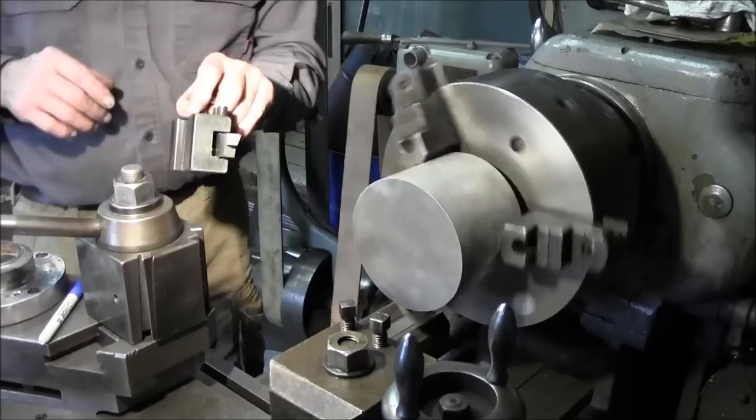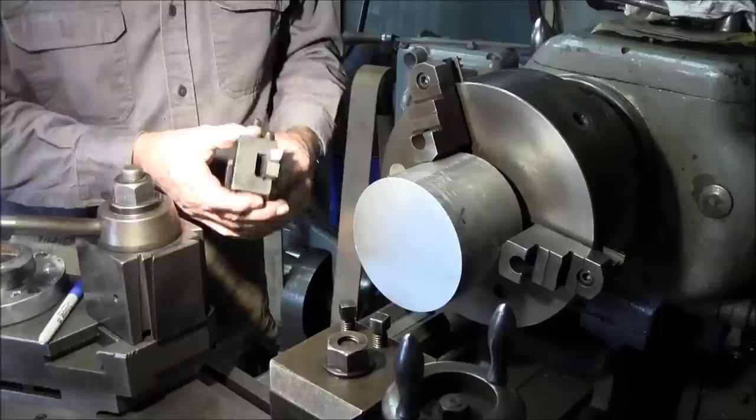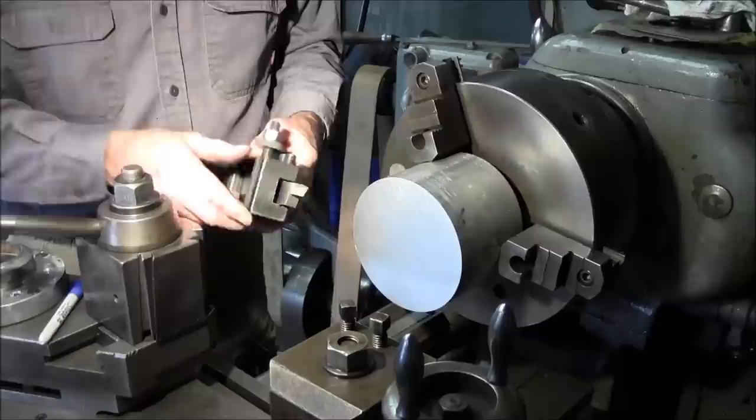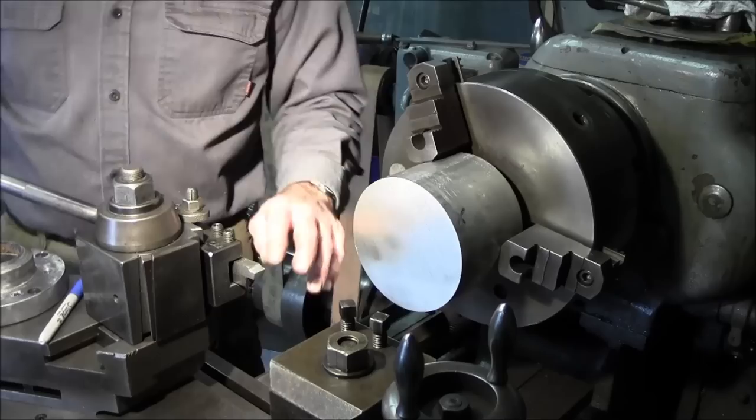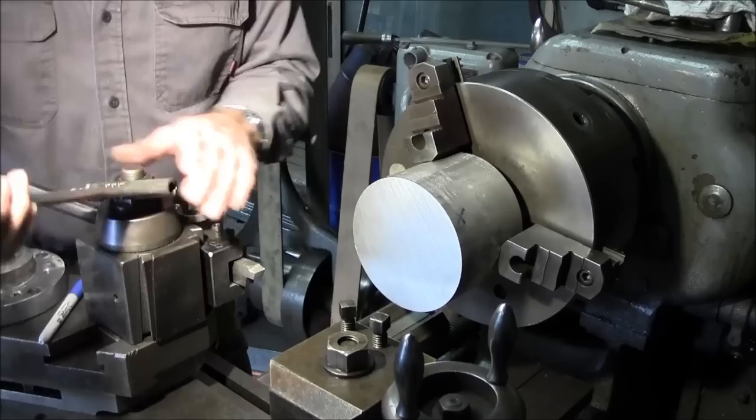All right, now we're going to be running. I already have high speed steel in here, and this is my standard turning and facing grind on that tool bit, and that's probably about a 4-year-old bit. So it is a little bit lower than it was, and it's a little bit angled back than it was, and there's been a lot of grinding going on here. But it's still the original shape that I put on the cutter to start with. And we're giving it an angle over here.